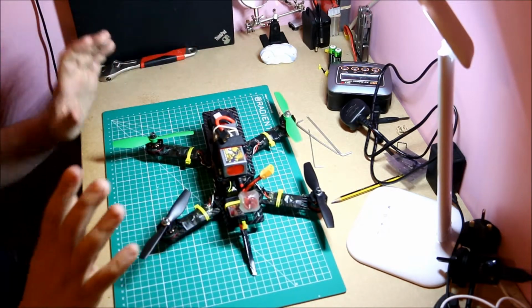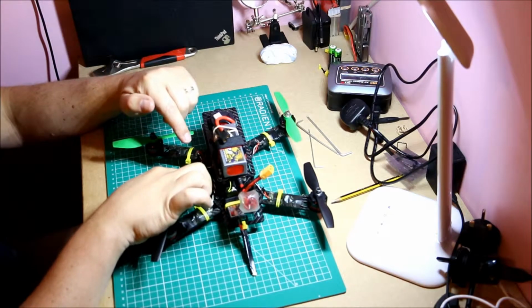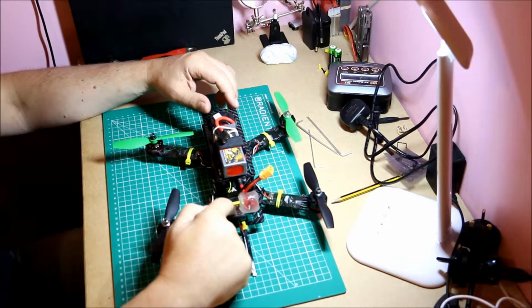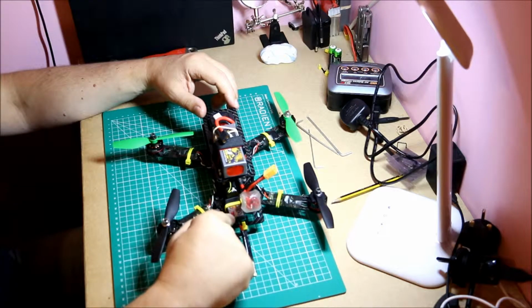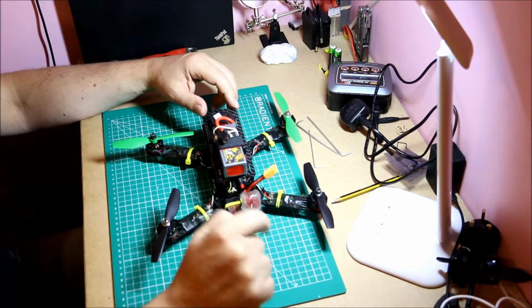So it worked fine, but just a heads up for yourself for later on. So motors, ESCs control the motors. Power distribution board distributes the power. Flight controller is the flight controller, like it says. Flight controller then connected to the radio receiver, which is for your radio control. This is a very old style one. It's connected on PWM, so a signal wire for every channel.